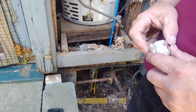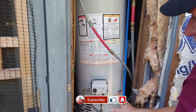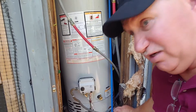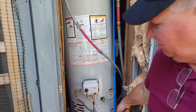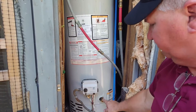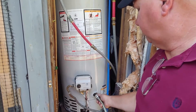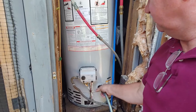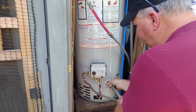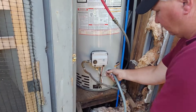So what we're going to do first is shut it off, and we'll shut the gas off here — which may have to have a pair of pliers, this old thing. It may not shut off. And then we'll hook a hose up, take this blade screwdriver, drain the water out.